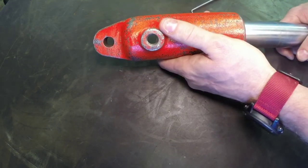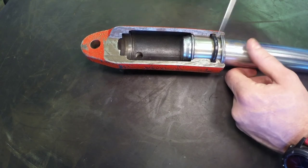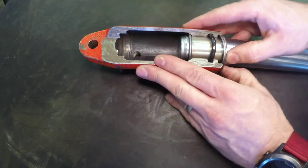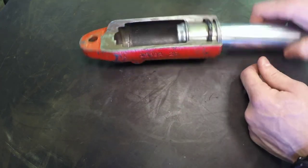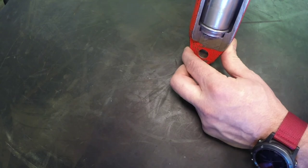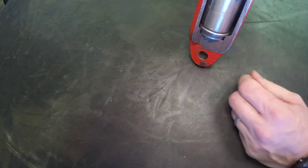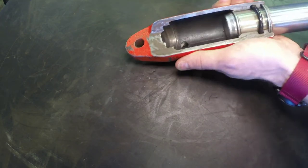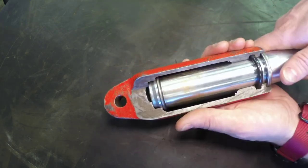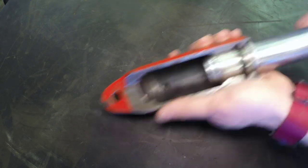You'll then be able to pull the ram type cylinder right out of its housing — it's quite simple to repair. Install new seals and a new lip seal or dirt seal on the outside. Lay it vertical, let gravity pull the cylinder back down, and tap it to seat the snap ring. Finally, extend it by hand using mechanical force — not air pressure — to confirm it bottoms out and doesn't pull past the snap ring.